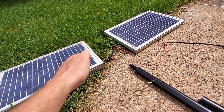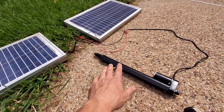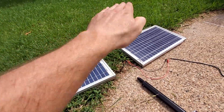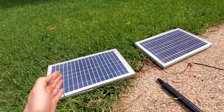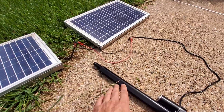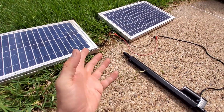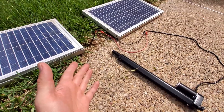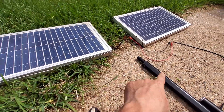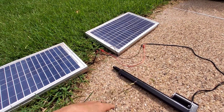Then reset back in the morning. My idea is to use these smaller panels to run this. If I position these smaller panels underneath the main panels, they're not in direct sunlight — but if the sun starts to peek on one side, it'll illuminate one panel and move the linear actuator until it's back in the shade and it'll stop. This is basically passive — no real electronics. If one panel starts to get sun it moves the actuator one direction, and if the other one gets sun it moves it the other direction.